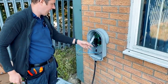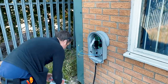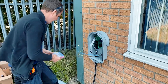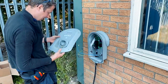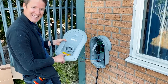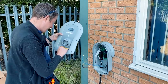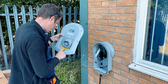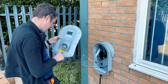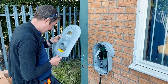I need to get my torque screwdriver out to torque these up to the correct setting. The label on the front of the Zappi actually tells you the torque settings. It says: check all mains terminals are torqued to 1.2 Nm, ensure ribbon cable is seated properly between the unit and front cover, all cables must enter using glands of at least IP65, and bungs provided must be fitted to all unused fixing holes.